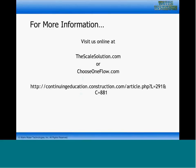One of the things, not knowing the company, that one of the pet peeves that people who have been in the water industry forever, and people like me that have sold softeners forever, is that when you use the term saltless softener, it really is a misnomer. It's used more to confuse, because there's really no such thing as saltless softening. If you're softening, you have to use an ion exchange. You have to take out the calcium and magnesium.